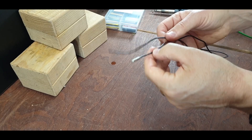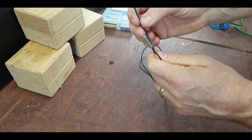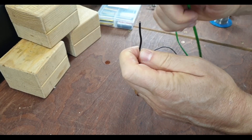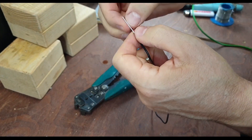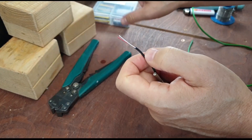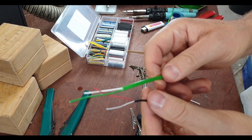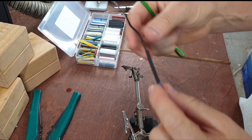This is the sensor I've just cut off, but obviously now it's in a different position this cable is nowhere near long enough - it's about three meters too short. I've got to extend it and I've got what is apparently the proper cable for sensors - some sort of special cable. These are really really tiny cables and they're going to be a bit of a nightmare. My plan is to do quite a large joint so there's a lot of copper touching copper, then heat shrink it. I'm putting a couple of different sizes of heat shrink on first because these cables are a different diameter - it's almost twice as wide.